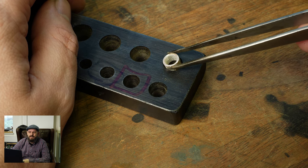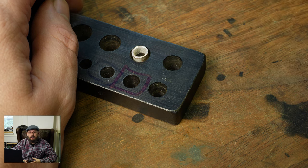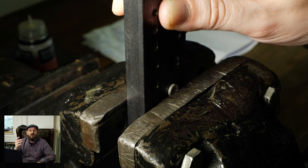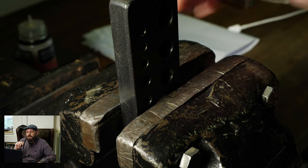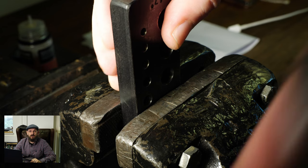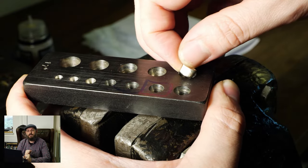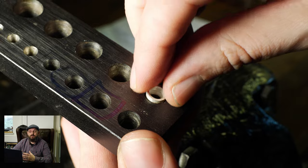The little marker with the little blue box around it — that's the hole in the collet punch that we're aiming for. We're going to start off in the bigger ones because we want to gradually pull that taper in piece by piece. You can do it on a press — if you've got a hydraulic press even better and easier, which I haven't got. I've got one of those mechanic 10-ton presses, but when it comes to the final stages and the last hole you need so much weight on it — I'm about 13 to 14 stone and I can't even get enough weight on that to pull it down — so that's why I just use this device. We're gradually going down further and further.